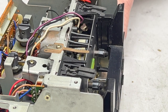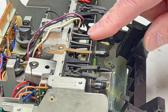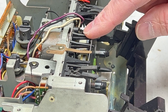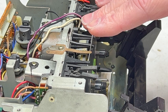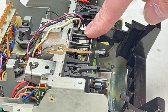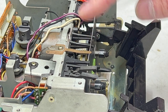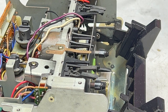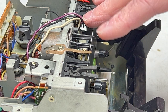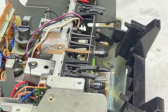First off, eject the tape. And the second thing we have to do is loosen the beauty plate. You cannot take this off with the transport in the deck. It's not possible. But you can loosen it enough to get at that back tension belt, I think. I've already tried it. I've had that belt off without taking this beauty plate off entirely. But I'll show you how to do it real quick here before we get to the back side of the transport.